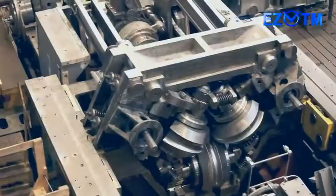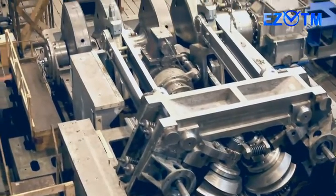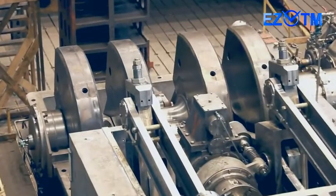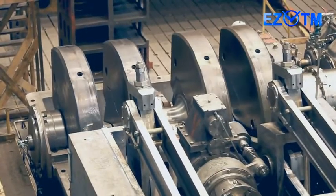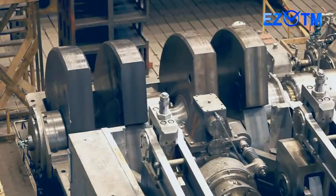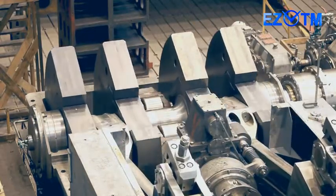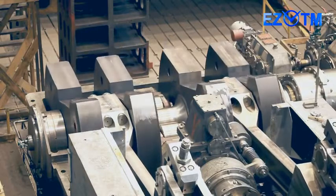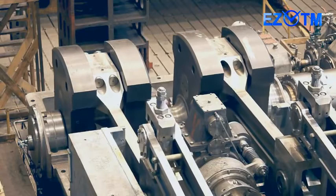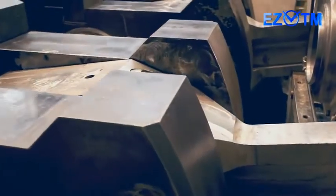The designed arrangement of stand unit and drive mechanism eliminates getting the high-efficiency mineral cooling lubricant of the deformation area on the foundation and eliminates mixing with the lubricant used in the drive mechanism. The scope of supply of CRTM 380 includes a range of accessories and special stands to assist in roll changing and equipment adjustment.